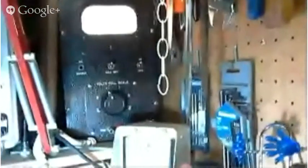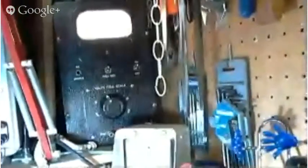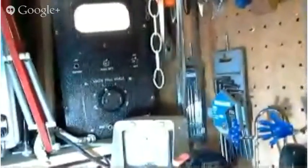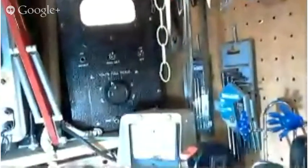Oh, also we'll be using this meter back here. I can flip it on now. This meter is a very precise audio meter. It measures audio frequency. It actually goes up fairly high, to be honest with you. And this is going to be very helpful as we do the alignment, since no one should attempt an alignment with their ears. I almost said earballs. No one should rely on their ears to do an alignment.